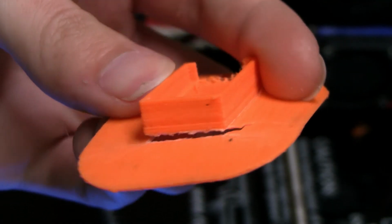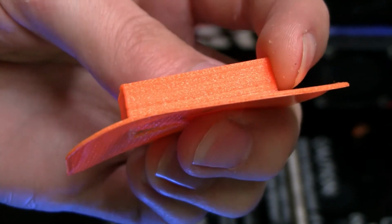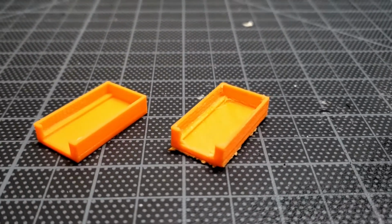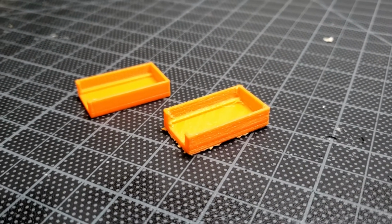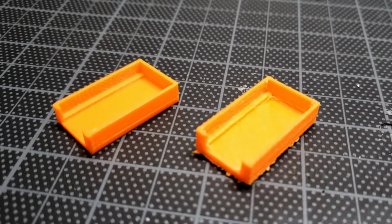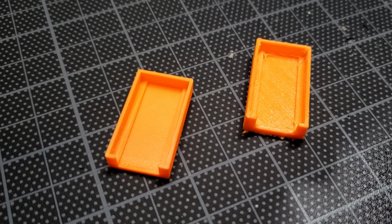You'll see in these final prints, I actually have the model that I originally printed on my good printer, which is much sharper and brighter and smoother. But I think that really comes down to temperature management, because mechanically this thing is moving beautifully, it's extruding very evenly, and the issue now comes down to getting the temperature right. So that's where I'm going to leave it.